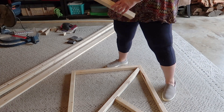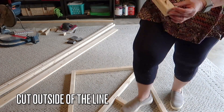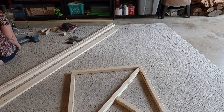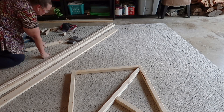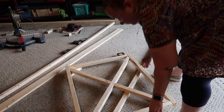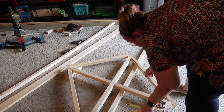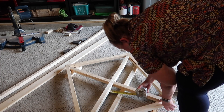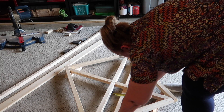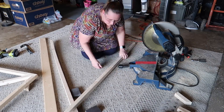I don't know if you've noticed, but when I'm cutting these boards there's a little laser line that turns on with the saw and shows you exactly where it's going to cut. I didn't pay attention to that until I was a couple of boards in, so I wasn't cutting directly on the line. I got lucky with the first couple, but this one I didn't cut short enough. From here on out I'm lining up the mark exactly with the laser so I cut it perfectly. I'm also measuring the distance from one board to the other — I want them about four inches apart, give or take — and I mark the wood from underneath where I want to cut it.